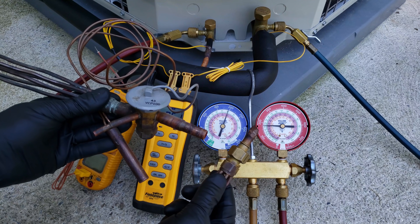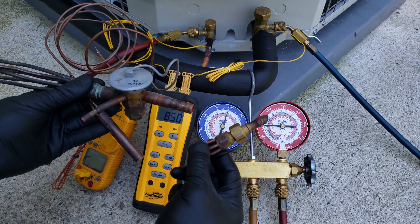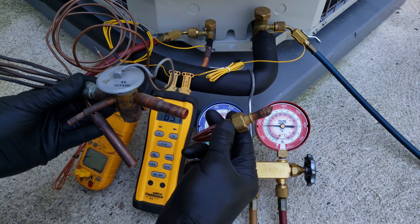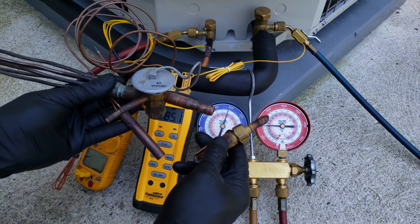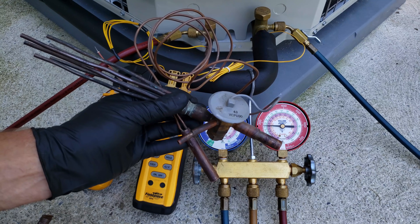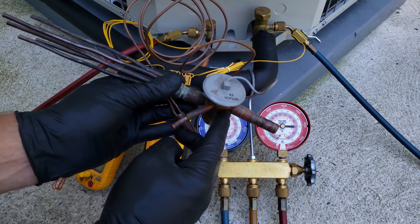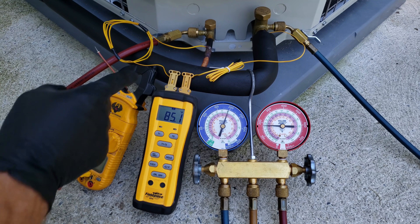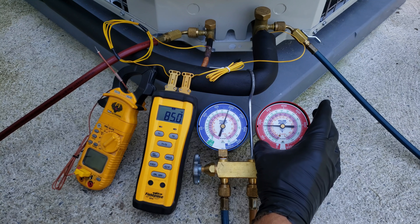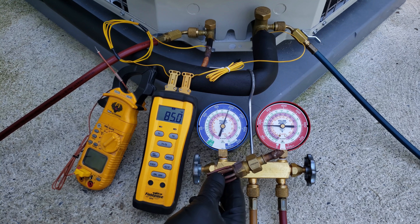If you don't know what type of metering device your system has, you're going to have to look at the indoor evaporator coil rating plate, or right on the outside of the coil you might see a nut — that would signify a piston. Or you'll have to take that box cover off and see if you have a fixed orifice such as a piston or a thermostatic expansion valve. If you have a TXV you're going to use the subcooling method, measuring the temperature on the liquid line and converting the red gauge reading to saturated temperature. Because we have a fixed orifice, we're using the total superheat method in this video.